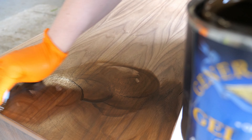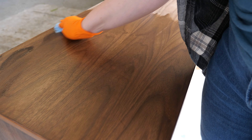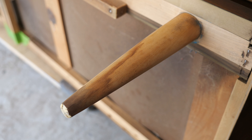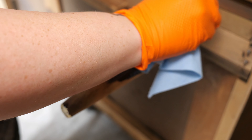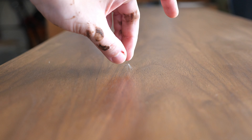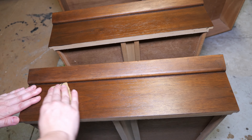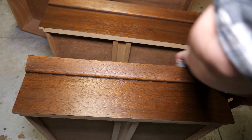Gel stain can be applied over existing finishes. The polyurethane coat also enhanced what appeared to be water discoloration on the legs of the piece. If you're really wanting to keep something like the legs a natural color and they have water damage or discoloration, this can usually be resolved with oxalic acid. I opted to stain them since they wouldn't match the piece otherwise. Once the stain had dried, I applied three additional coats of aerosol polyurethane, and after that final coat dried, I sanded the surface to remove any little imperfections that landed while the final coat was drying, using a high grit sandpaper.